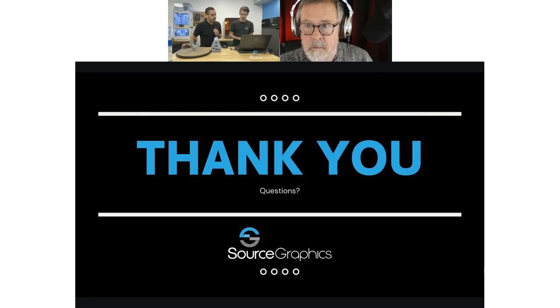Peter had commented: a live hand can be a challenge because people have a tendency to move their fingers during the scan. This is very true — people are very difficult to scan. The Space Spider is down to about 50 microns in accuracy, others about 100 microns. If you move just slightly they'll pick that up. People tend to be one of the more difficult things to scan.